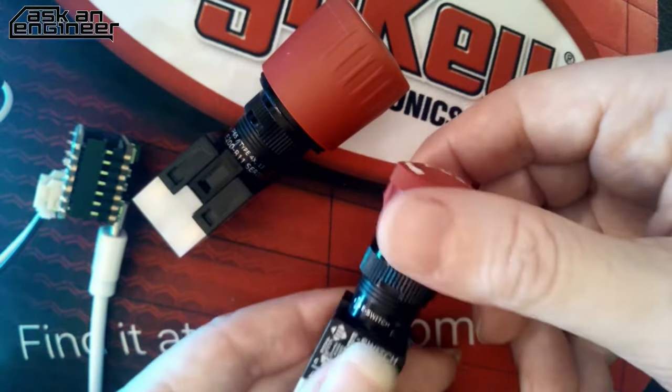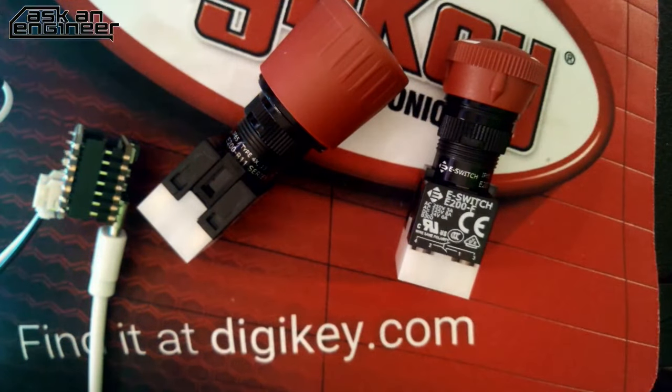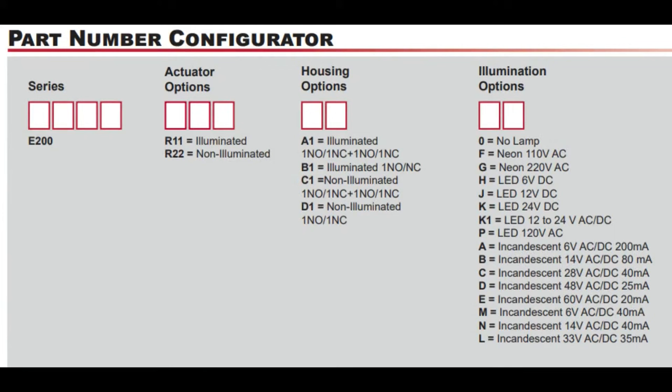This kind of design means the immediate action is to turn it off, and if you want to turn it back on, you actually have to do a little thinking - you have to twist it in a specific direction. This comes in two variations but both are basically the same body; it's just the knob that's different. You drill a hole to mount it and pull a notch so it doesn't twist. Digi-Key carries two options: without illumination and with. The illuminated one only comes with a red 24-volt LED, but there are other options - neon if you want it literally in line with AC power, or 6-volt, 12-volt - you probably want the LED in line with your power so it really indicates whether there's power coming into the machine, and also handy if you have a ground fault or something shorted inside.